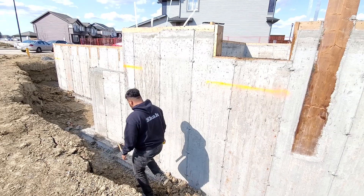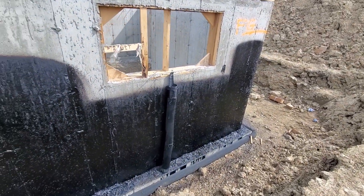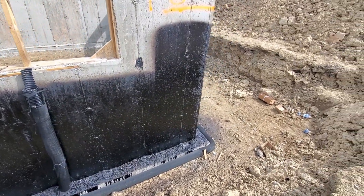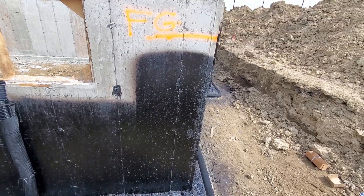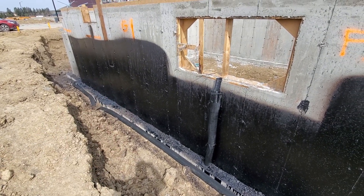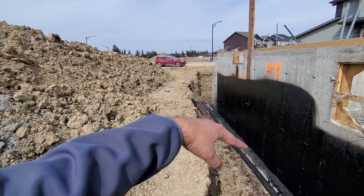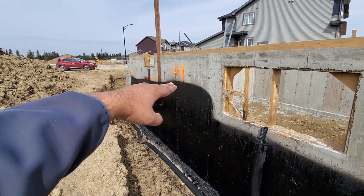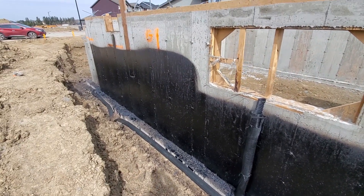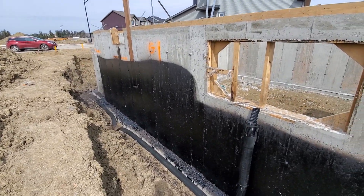We cannot backfill for at least one week after you pour — you have to let the concrete cure and gain appropriate strength before filling the dirt back in and adding that load on it. In that one week we're going to get our weeping tile completed, they're going to run the underground service line for the electrical, and then we should be ready to fill it back up. We have our plumbing groundworks happening right after the backfill, and once my application goes through our gas line will be installed — they come and do their own trenching, run their own line connected to the main city line, and install a meter on site.